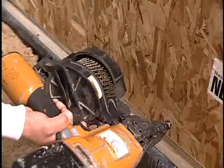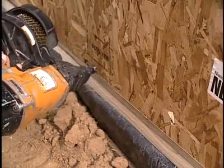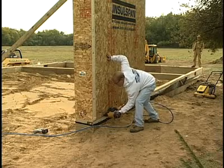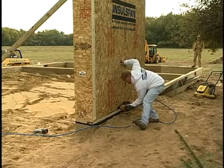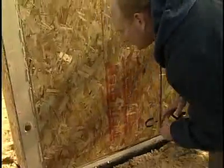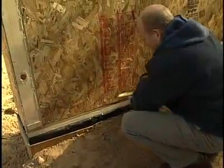What kind of fasteners do you use? In that situation, through the skin into the wood, we use a minimum six-penny nail. More typically on a job site it's an eight-penny nail collated, nailed off in the approved schedule of nailing. If it's a job without special requirements, six inches on center should be adequate, but that again is on the panel drawings to tell you exactly how often to put the nails, what kind of nails to use — it goes back to that road map approach.